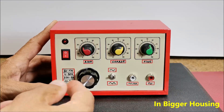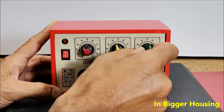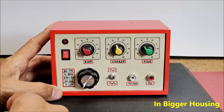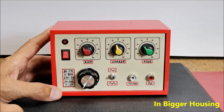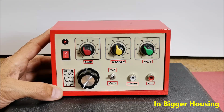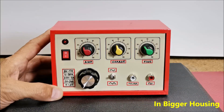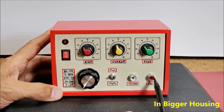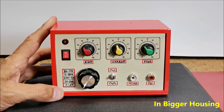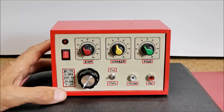Of course there are also potentiometers for amplification, coarse and fine tuning of the generating frequency. The specifications of this device are: power supply from 9 to 12 volts, sine and triangle waves with amplitude of 0 to 3 volts, and rectangular signal with an amplitude of 8 volts. Distortion and linearity are less than 1% up to 100 kHz.